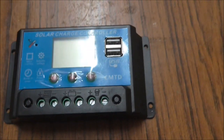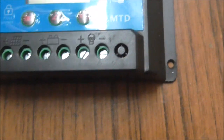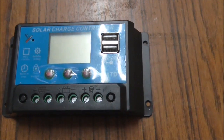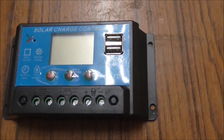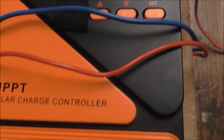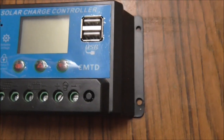I did try the standard PWM controller for the pump - this is a spare of the one originally fitted on the boat - and it's supposed to have a 10 amp load rating, but it wouldn't work. The pump would just try to start and stop immediately, so that unit cannot carry the pump load. This MPPT unit is able to carry it. I was seeing something like 4 to 4.5 amps running, and at one stage I thought I saw over 7 amps - though my clip-on ammeter may not be quick enough to capture the instantaneous loading. Certainly the other one, also rated 10 amps, couldn't do it.